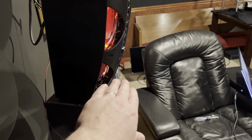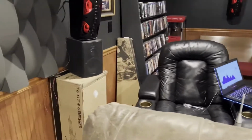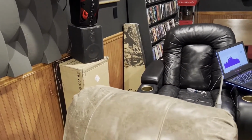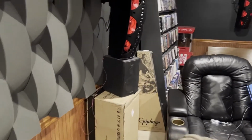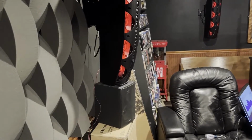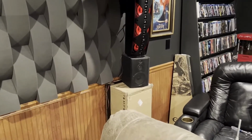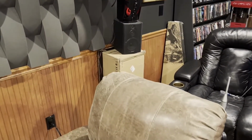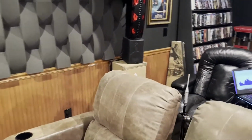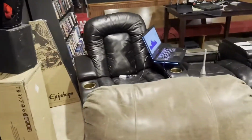The drivers are shaded with the crossover network. And so this seat here on the bottom, it's closer to the bottom portion of the speaker, which means it's going to get attenuated sound. Now, in that previous video that we linked, you saw how nice, flat, and uniform the JBL CBTs are off-axis. That's going to play to our advantage because we have that nice, uniform, off-axis sound, but you also have the attenuated sound from the nearest seat. How that reveals itself is if you're watching movies at reference in this theater, if you're sitting in this seat, you don't get your ear blown out by the surround speaker because it's attenuated in that closest seat.